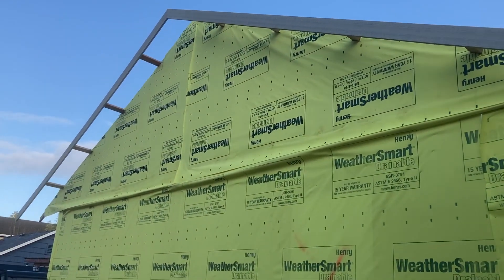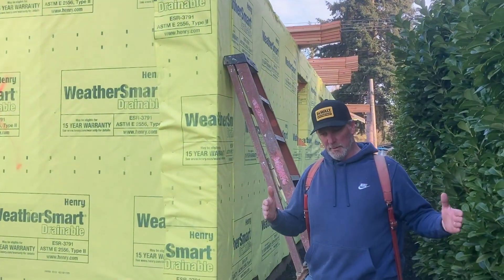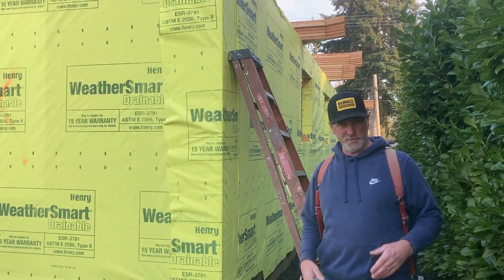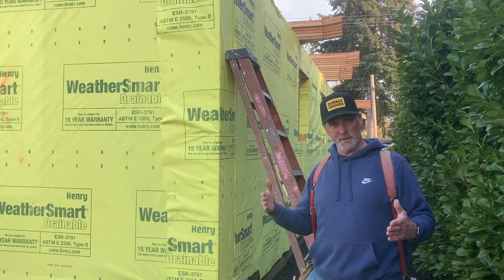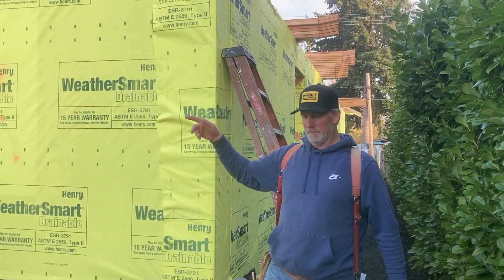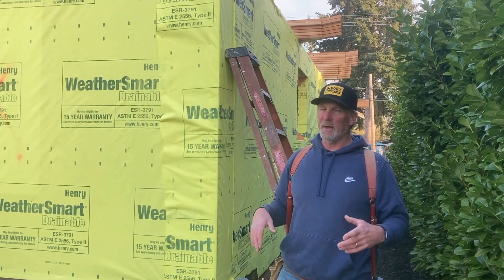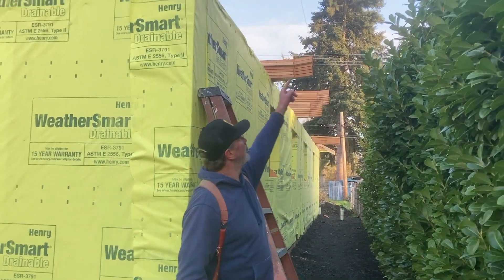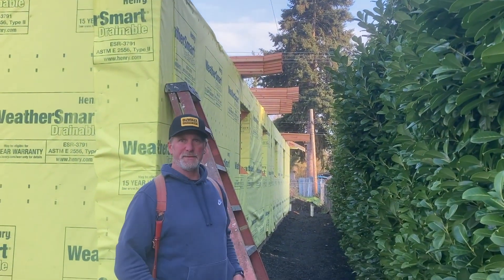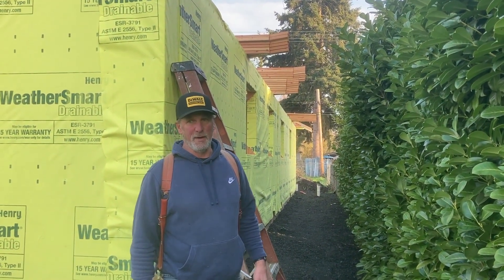There are a number of ways to set trusses. Typically you'd line the bottom cord of the truss — the little nipped-off corner — up with the outside of the wall, which you've straightened, so the roof trusses are straight. Trusses these days are pretty consistent; it wasn't always the case. Sometimes you'd have to trim all the tails — that portion of the top cord that sticks out beyond the building — snap a line, cut them off with a saw. They're good enough these days that if you get them all straight, there's no need to cut them off.